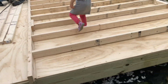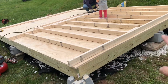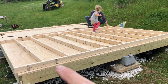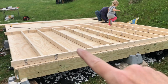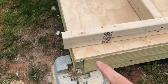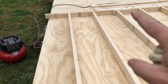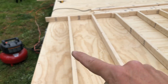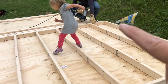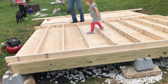So what we're going to do now is, since this back wall, this short wall is 12 feet, there's no windows or doors on it. So we're just going to put it together. They're 93-inch studs we got at Home Depot. We laid it out at 16 inches on center, and we marked the top plate the same, and then just putting these 2 by 4s all and Jake's nailing those up, and then we'll stand this wall up, and I'm going to start over there.